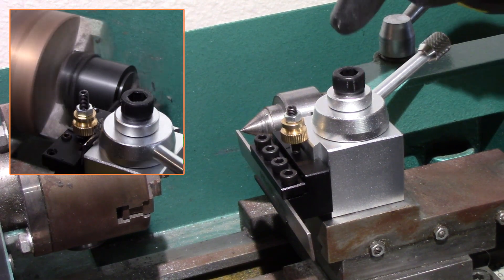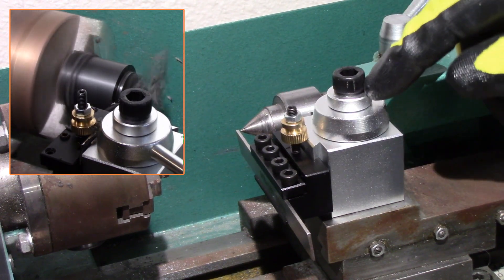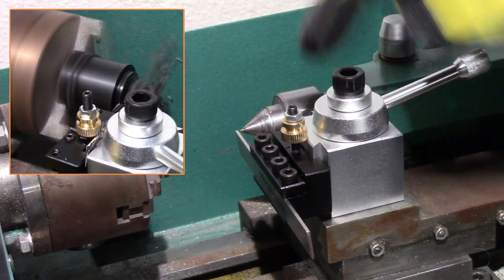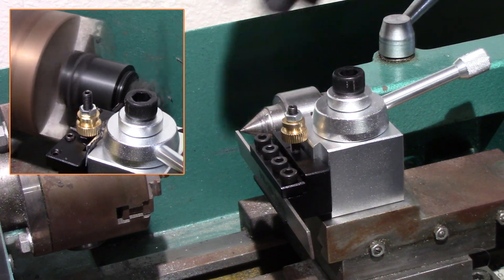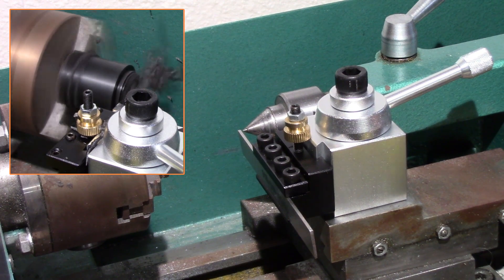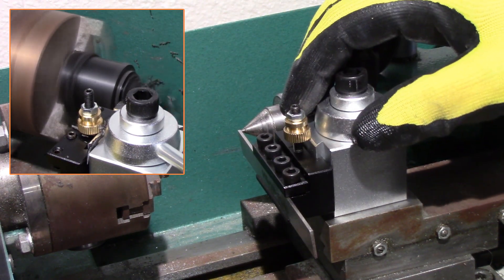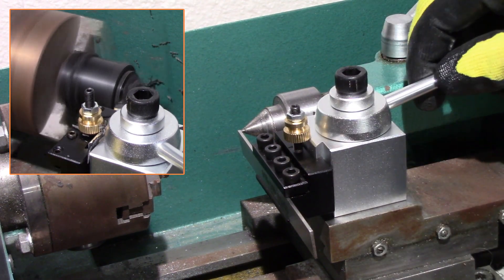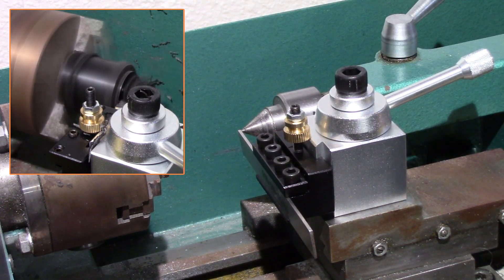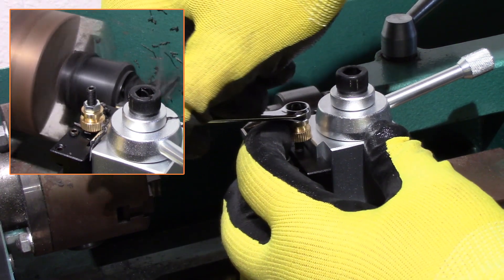One of the things I noticed — I think it's Dave M on his channel, he does the Mini Machine Shop. He made a different bushing, but this appears to be a little bit different than his version where this bushing actually bears the load, and the cam just simply tightens down. Now we're aligning the cutter. I have my tailstock in with my live center, and you can see where the tip is on the live end. I want to match these two up because they should be just perfect. I use the brass knob here as an adjustment. Make sure it's not catching on the piston, and keep in mind when you tighten it, it might move a little, so you might have to do a couple of iterations. For general purposes, this looks good. I'm going to hold my brass nut and lock it in with this wrench on the top.